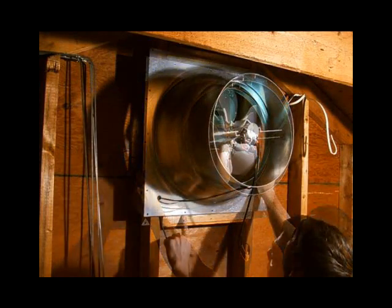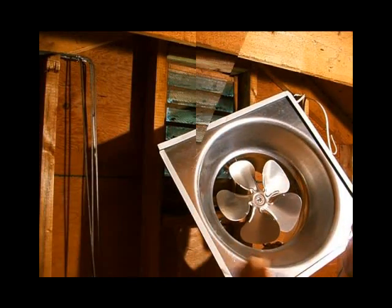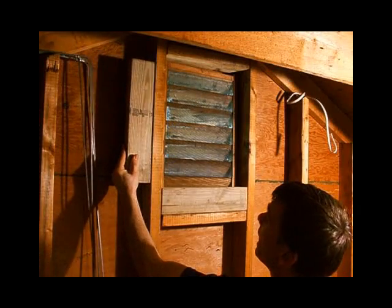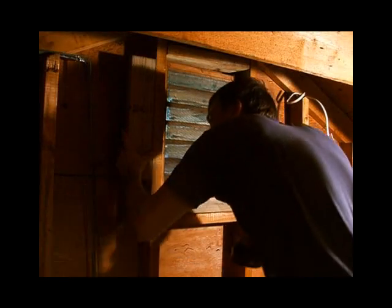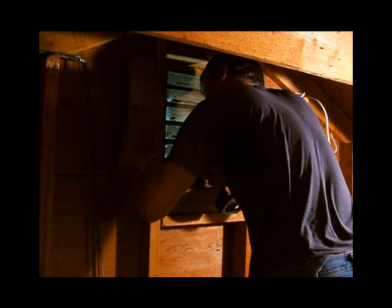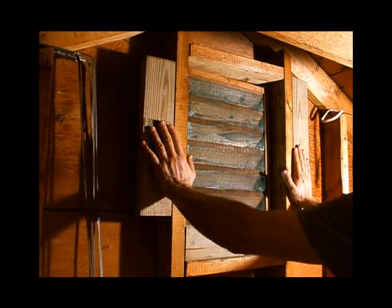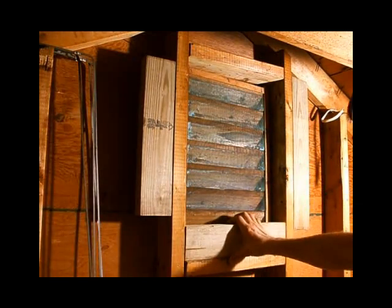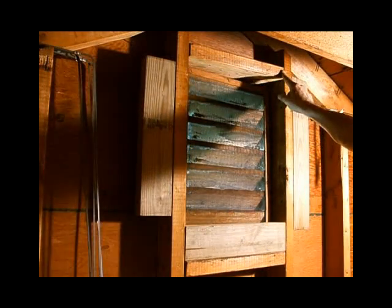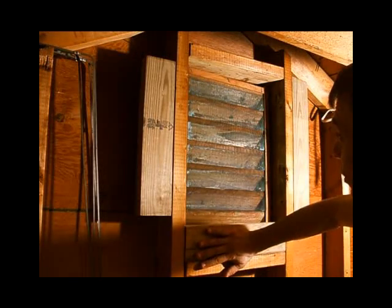The goal is to create a good meeting surface so you can hang the fan using the pre-drilled screw holes located around the perimeter, and to make an air seal against the wood using the pre-installed weather stripping. Using some spare 2x4 lumber, I blocked in the lower edge — which wasn't a problem because the lowest vent slat was already closed off — and then I added blocks on either side. They didn't have to be load bearing because the top and bottom edges of the fan housing could now be secured to cross members. Here's how it looked with the blocking in place, making a good meeting surface all the way around. The only minor problem was that the boards I used on the sides were too short, so the weather stripping in the corners on the housing wouldn't contact the wood. I had to lift and re-stick the weather stripping in the corners to make little jogs so that I had a complete seal.